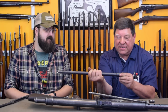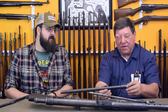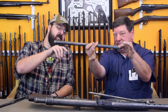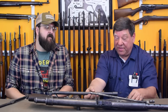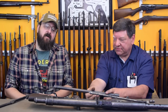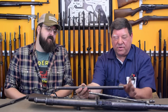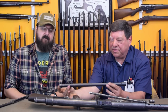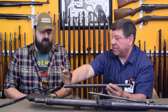It does draw up tight, but not tight enough. It just slips out. When I got it back the last time after we'd fired a couple of rounds, it was cracked like that. We've tested this. When we tighten it back down with that, basically it's being held on by about 2 threads. Then we went to retest fire to see if that would hold, and the gas system blew it right out. The other problem is that as we faced this way, this entire gas tube moves this way, so it was coming precipitously close to falling out of the indexing ring in the back.